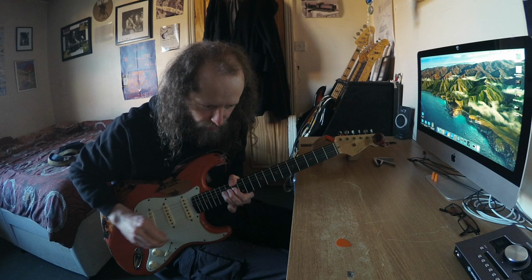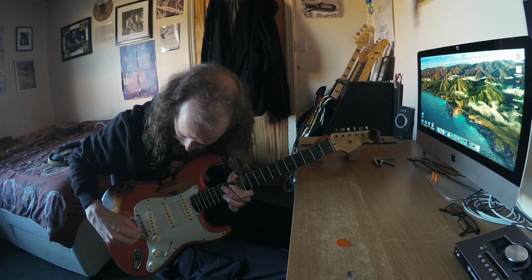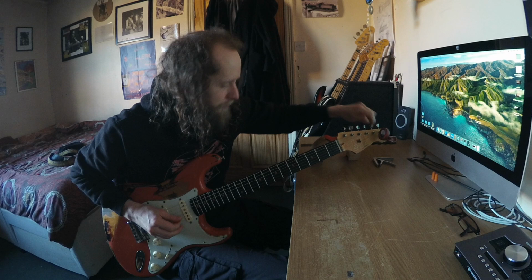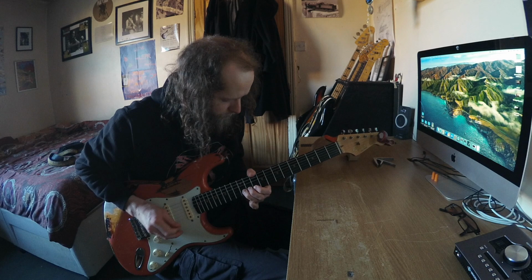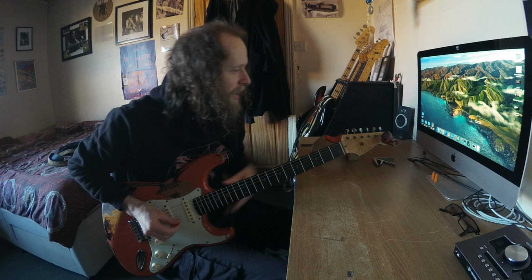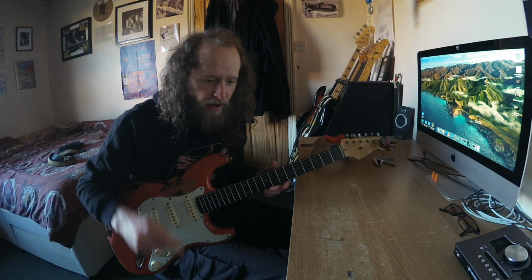Okay, what I'm going to do is, again, Allen key. I'm going to do like half a turn on each grub screw, and then retune and check it. Not bad. I think we can get it a little bit better though. So bring up again. I'm on to micro turns now though, people tube. Literally there, that wasn't even like 5% of a turn. The first time I did it half a turn. And then that time it was basically nothing.